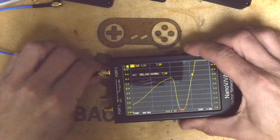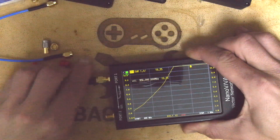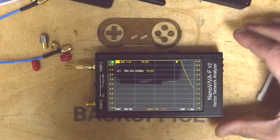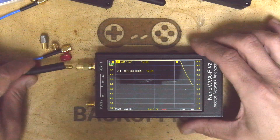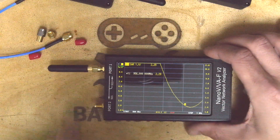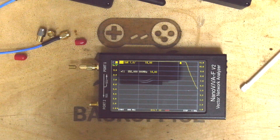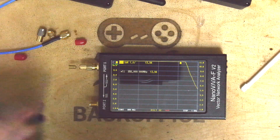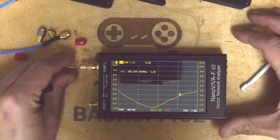What you could do — and if you've ever made your own antennas you'll be familiar with this — is go online and get a calculator to work out the correct lengths. In fact, look at that — just moving that plastic cover has actually changed the resonant frequency. That has blown my mind. Even the cover of an antenna has an effect — some sort of capacitance or loading. And if I move my fingers near it, you can see it's actually adjusting the reading.